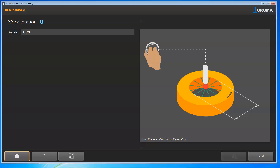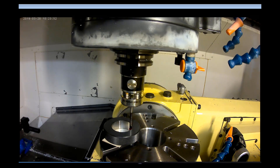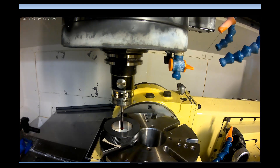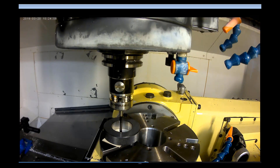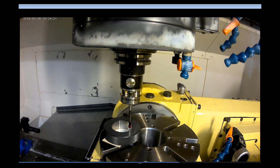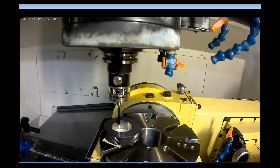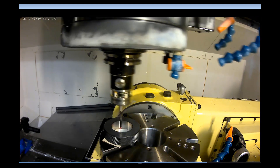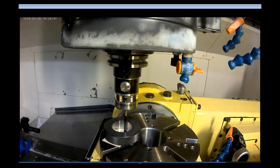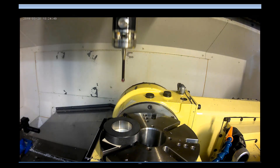Once you send that to MDI it will send a piece of code into the buffer and you can hit Cycle Start to execute the process. Once you execute Cycle Start, the probe will start touching the quadrants of the circle to find the center, and then it will do vectored probes into the ring gauge to get a dimensional value from spindle centerline to the outer portion of the ruby in every direction it will move. As a footnote: on the first time you execute this cycle it is not a bad thing to have your feed rate turned down below 100% just to make sure nothing goes wrong. However, once you're certain the cycle works, make sure you do the final calibration at 100% feed rate, because the switches in the probe may trigger at a different time if your feed rate is modified during calibration.